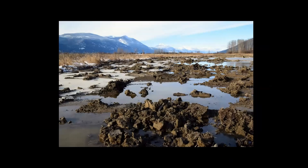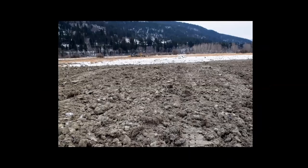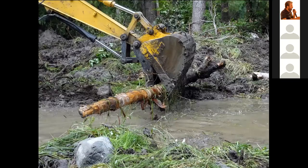Here's a portion of the wetland dug the day before — the depressions are filling with groundwater. Here the dozer is shaping soil that was allowed to freeze overnight so it could be shaped without getting stuck in the mud. When building a wetland using the groundwater technique, if you build a one-hectare wetland, you'll need one hectare of land to spread the soil — like taking a pie out of a pie tin. We place and plant clumps of native vegetation — sedges and rushes — in the wetland, and also place many logs to provide habitat for a diversity of wildlife species.